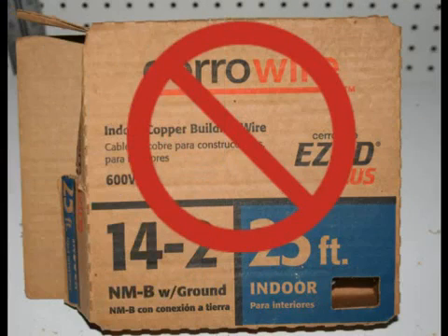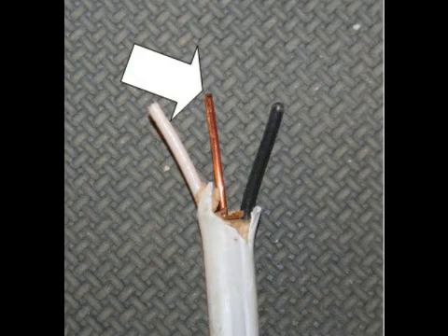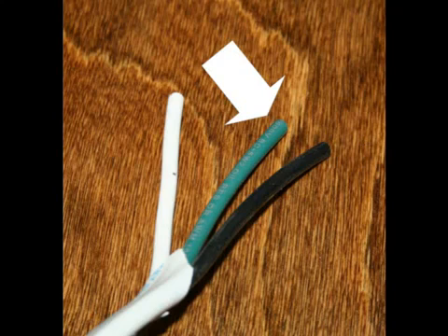Now let's talk about the right wiring to use. Don't use household type wiring — it's just not right. As Jack Hefner from Gratitude Yacht Center pointed out, it's not safe and you're not going to do well on a boat survey with the wrong kind of wire. On the household wire, the ground is not shielded and it's solid copper. Compared to the marine grade wire, which is stranded, flexible, and the ground is also shielded. This wire is also tinned so it holds up against the harsh marine environment a lot better.